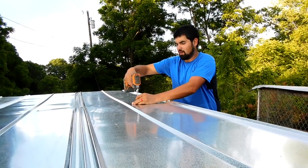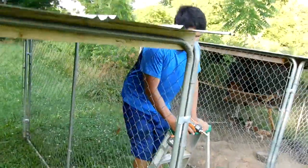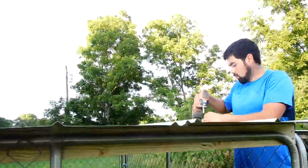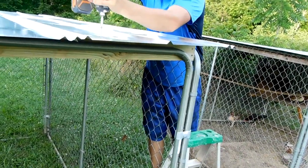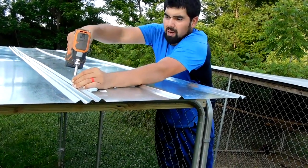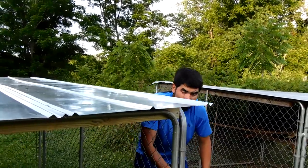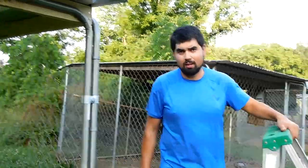You can kind of feel for them too and know exactly where they're at. Drill them in — it's perfect with the rubber washers, so it keeps it from leaking. I kind of leave a little bit of shed roof right here in case it rains, so the rain or snow won't blow in on them too much. It's already going to come in from the sides since I don't overlap it too much from the sides. This roof right here is guaranteed for life — there's no going back and doing it again. Sometimes in winter I just get a broom and brush it off. If you get a lot of snow and live up north, you can put another cross brace going across to hold the center up, or even a little post going down to hold it up even stronger.